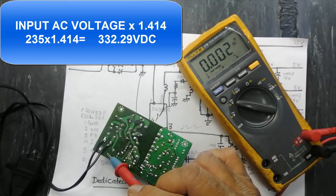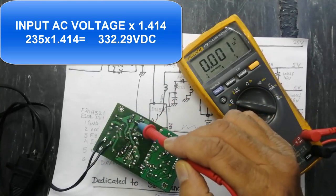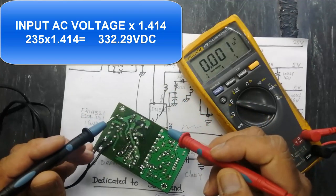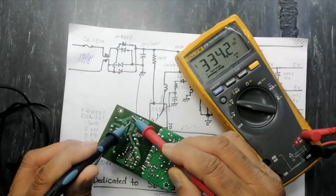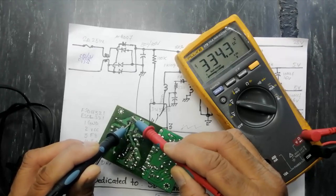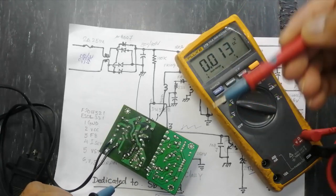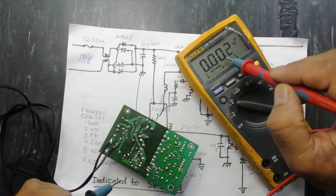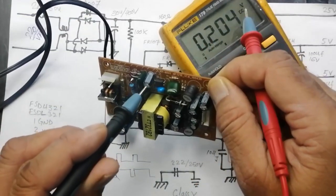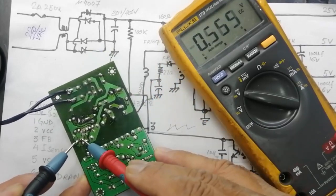The stored DC voltage at the capacitor must equal AC input multiplied by 1.414. For example, if AC input is 180 volts, multiply by 1.414 and that calculated voltage should appear at the capacitor. The second check: this voltage must be stable. If the meter readout is jumping — for example moving from 310 to 330–340 volts and back — that fluctuation means there is a problem in the circuit. Next, check the VCC capacitor voltage.